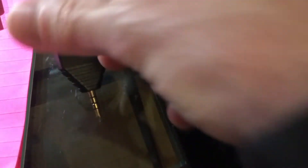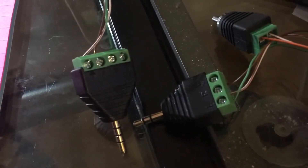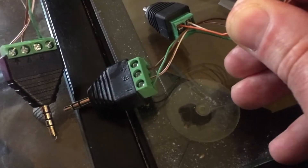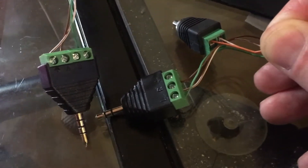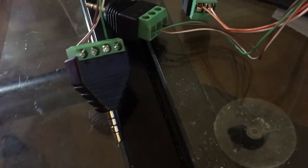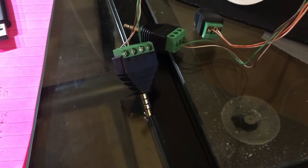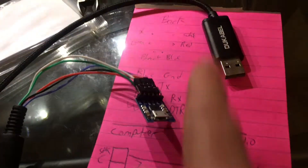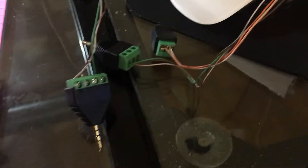I got these connectors off Amazon. They're just screw connectors, and this is an old piece of ethernet cable. You can see TRRS — tip ring ring sleeve — and TRS — tip ring sleeve. You probably want to ignore the raised lettering on those connectors, because in this case it lies. It says the sleeve is ground and the next one up is microphone, but it's actually the opposite way around. So you just plug the USB audio into your computer, plug this in, then plug this to the data port of your radio, and you're good to go.